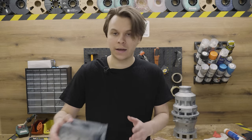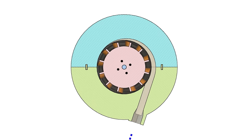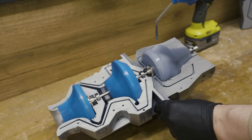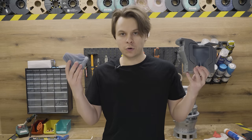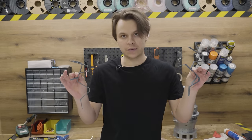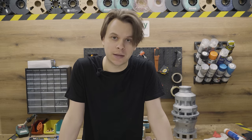Also I redesigned the input. Right now, before the air hits the turbine, it has a curved pathway — I was thinking it was actually better, but it turns out it's not. Because when I shoot the air to the turbine, it made a huge difference at what angle and where I point the airflow. Now I changed it so the air moves in a straight path to hit the turbine. Those two are the major changes. The one minor change I mentioned are these sealing pieces — they are for air leaking. They should have already been there, but I just forgot to print them before. I assembled the device exactly the same way as before, so let's see how much it helped.